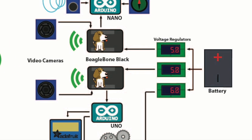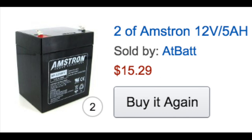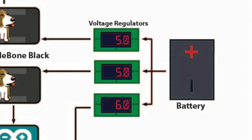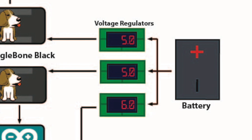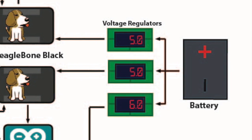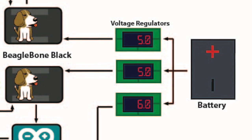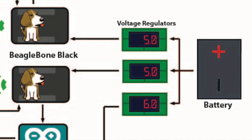Babbage is powered by a 12-volt sealed lead-acid battery. I went through a number of battery configurations, and this one seemed to work the best. At first I tried using banks of AAA batteries, but I quickly found that they didn't supply enough power to run everything at once. I decided on a sealed lead-acid battery because despite the weight, they deliver a high enough current to run multiple systems simultaneously. The onboard computers require a 5-volt power supply, so I thought a 6-volt battery stepped down to 5 volts using a simple 7805 voltage regulator would be enough. The 7805 steps down voltage and sheds the energy as heat — the problem was that it wasted a lot of energy, decreasing the battery life. Also, it got really hot.